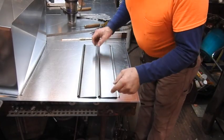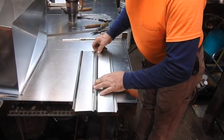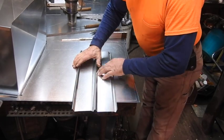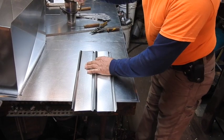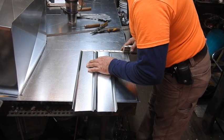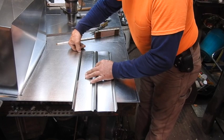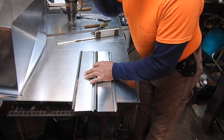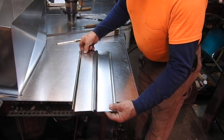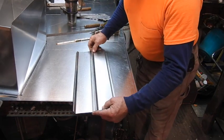The end result should be an interlocking piece where when everything rotates they'll interlock over the top of each other. The starting-out dimension should be very near the width of your duct, which is 8 inches — we have 7 and 15/16 inches, which is a little tight. I may need to trim just a bit to clear the Pittsburghs and the two opposing corners. You'll see how these rotate to open the airflow and then close to block airflow.